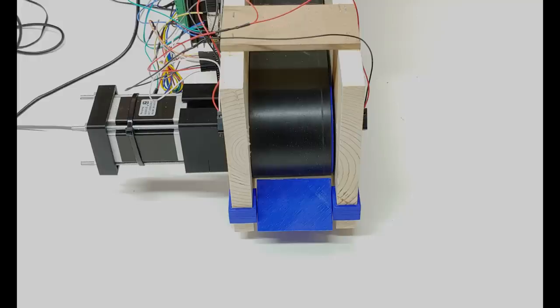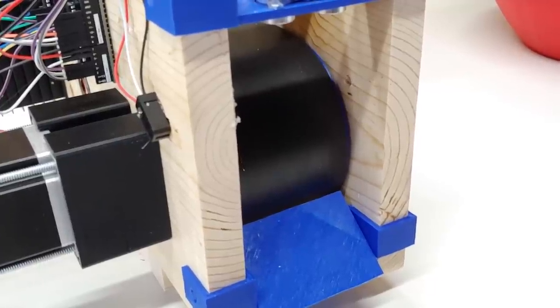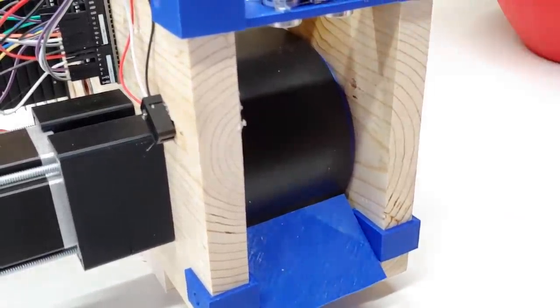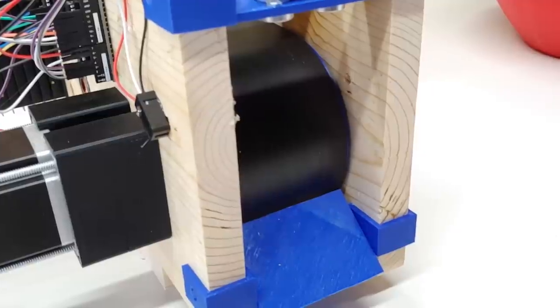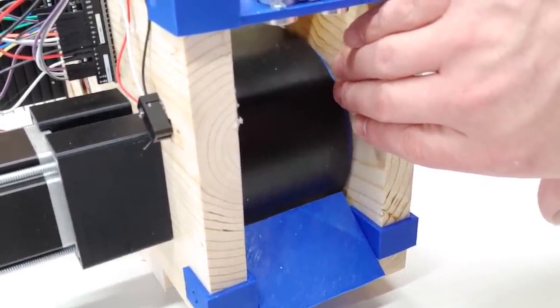To solve our proximity sensor problem, my wife said a break beam sensor would be superior in this application. The infrared break beam sensor works by sending an infrared light from one end and receiving that light on the other. When that light is no longer seen, then there is something interrupting the beam, in this case, a piece of candy. While the beam is interrupted, the belt is told to move slightly, then wait about a quarter of a second. This sequence will repeat until the beam is no longer obstructed. This tells us that the candy was successfully dispensed.